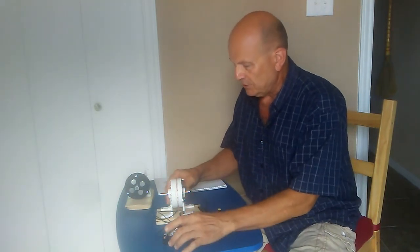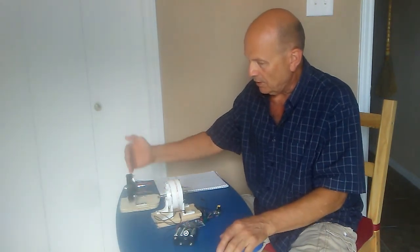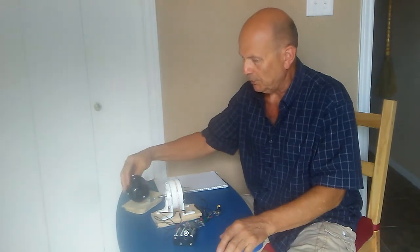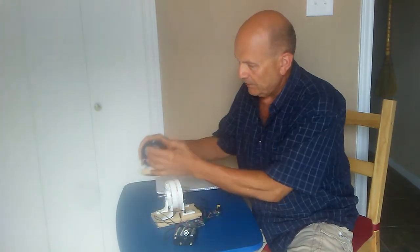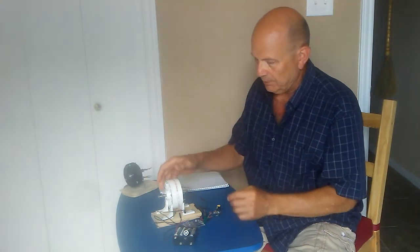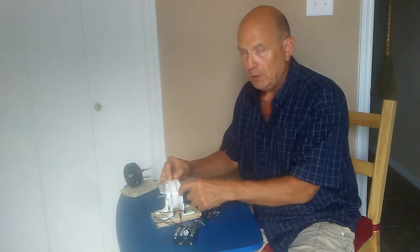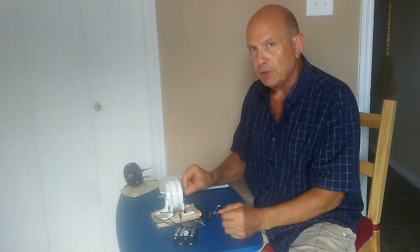And this is an axial flux. It means the coils are perpendicular to the drive shaft, and so the flux is parallel with the drive shaft. What that means is that I could put another stator on here and another coil. I'd rather talk about this motor here because this has dual rotors. I already have 2 rotors in here with a stator sandwiched in between them. So it's running 2 rotors simultaneously, giving you a pretty good amount of torque.